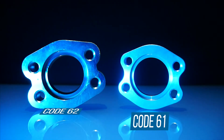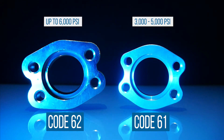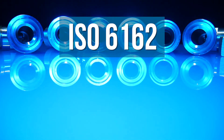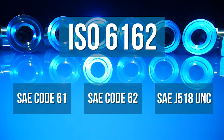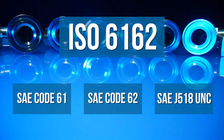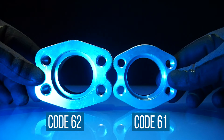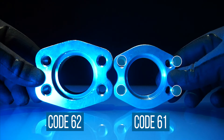There are two primary types of flanges. SAE Code 61 flanges are used for applications requiring working pressure of 3,000 to 5,000 PSI. SAE Code 62 flanges are used for applications requiring working pressure up to 6,000 PSI. The hydraulic flange standard is ISO 6162, which includes SAE Code 61 and 62, or SAE J518 UNC thread North American standard, along with international standards with metric threads. It is important to note that the two flange style codes, 61 and 62, are not interchangeable due to their pressure ranges and their different bolt patterns.